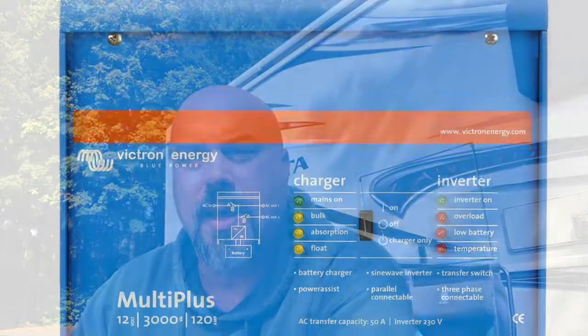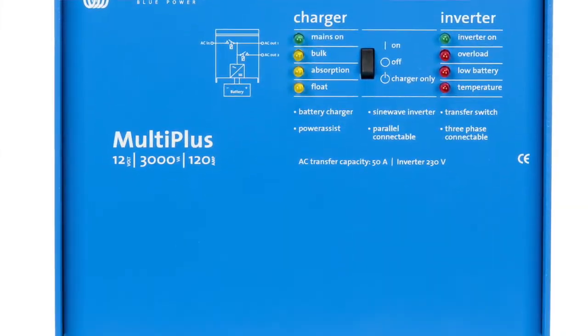So what did I do? I went with a Victron MultiPlus 3000-watt pure sine wave inverter. One of the great things about it is you can program it for different battery types. Do you have flooded lead acid? Do you have AGM? Do you have lithium? How many amp hours do you have of those batteries? What's the charging profile of those batteries? You get very specific on your bulk charge versus absorption, or is there a float — the different stages of charging a battery. It's also a pure sine wave inverter, so my electronics don't hum or buzz when I use my inverter anymore.